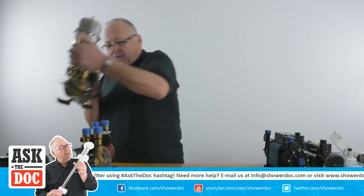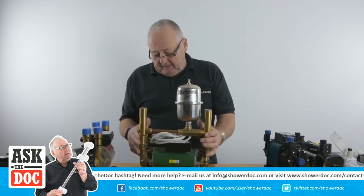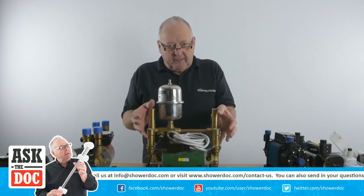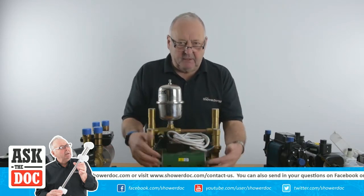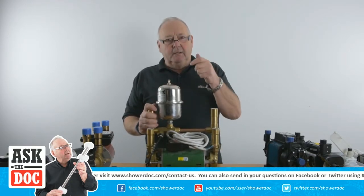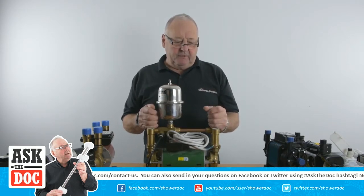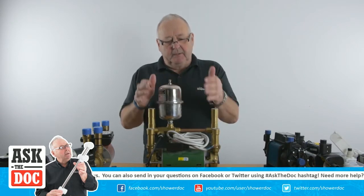Finally, we get to this kind of thing, which looks a bit of a brute but it's the same sort of thing. It has the circuit board on the top, the pumps at either end, but this has a pressure vessel on it, and this is now called a universal pump. Some of the other ones have two smaller vessels, one for the hot and one for the cold. The latest ones are now mounting the pressure vessel down on the side. Turn the tap on, it senses the flow. Whenever the pressure drops in the pressure vessel, it senses that, the pump starts to run and it will keep running. Turn the tap off and it builds up the pressure again, and once it senses the pressure is fully up, the pump shuts off.